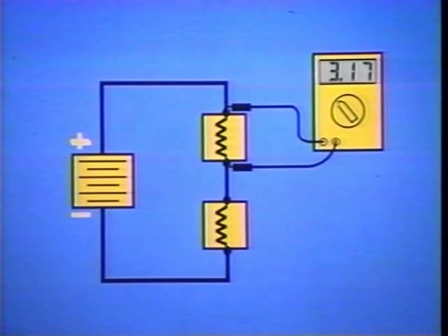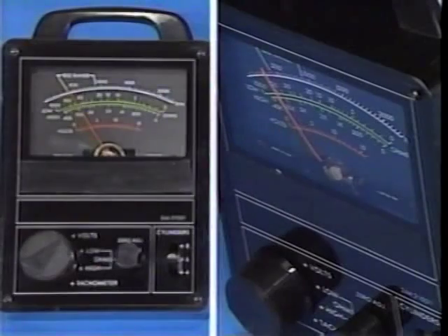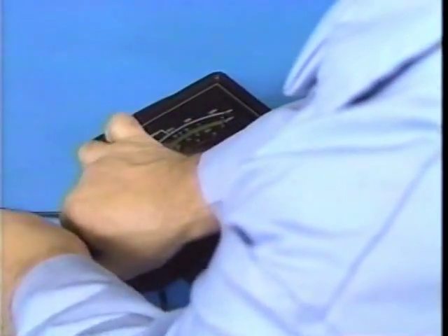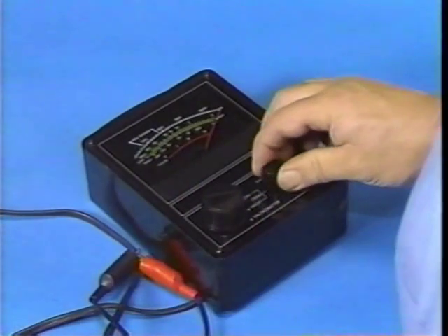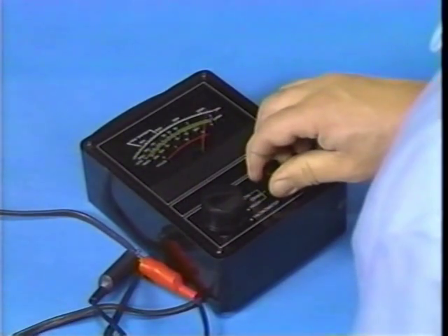Let's see what reading we get using a high impedance DVOM. This DVOM reading is much closer to 3 volts than the analog meter because the DVOM only uses a tiny amount of the current from the circuit. Analog meters have other shortcomings besides inaccuracy. For example, analog meters seem to give one reading when viewed straight on and another when viewed from an angle. And before measuring resistance with an analog meter, the needle must be adjusted to point at zero to compensate for meter battery discharge and test lead resistance.